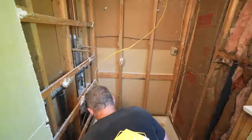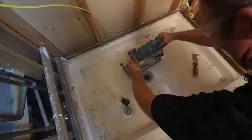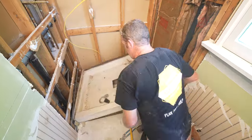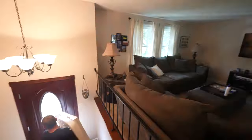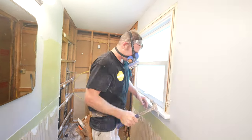Removing the shower pan — most of the time it's just easier to plunge cut with a circular saw so that you don't harm the plumbing underneath, and then you just yank that shower pan up. You can also use an inside pipe cutter as well, but a lot of times plunge cutting with a circular saw really helps out.